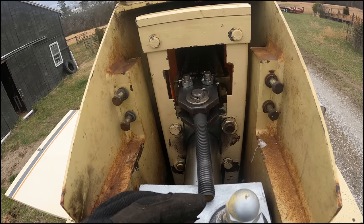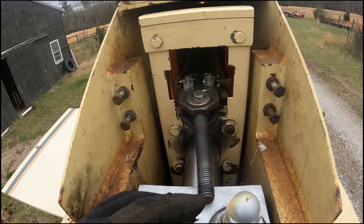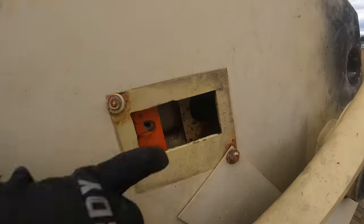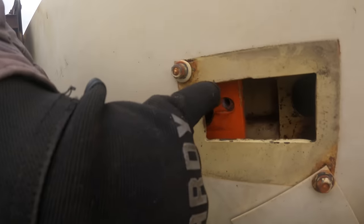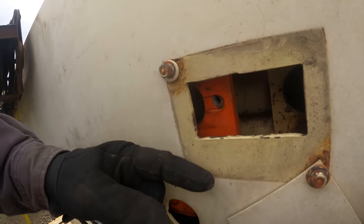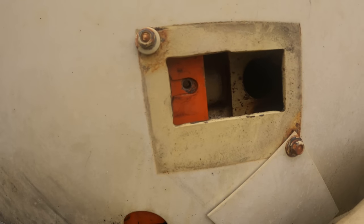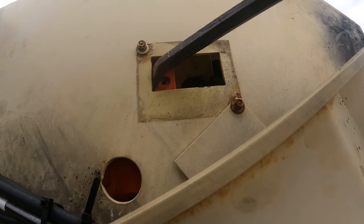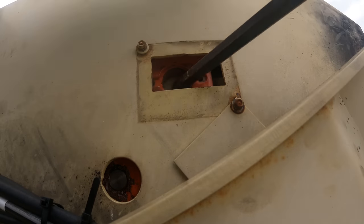So now I'm gonna try to get the mid boom and the half pins in. So let's see if I can use a crowbar and move that mid boom back. The cylinder is right there, and there's the mid boom. So the mid boom needs to come back a couple inches, cylinder needs to go forward a couple inches. And I'm hoping a crowbar will do that. Come here. So lining this up was one of the few things that went way easier than I was expecting. I'll take it.